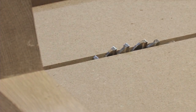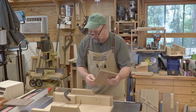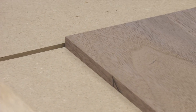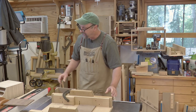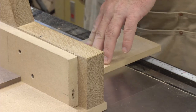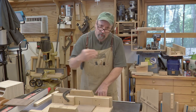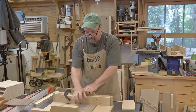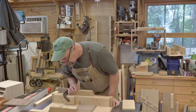I have a tick mark about a half an inch in from the leading edge of this piece, and I put that against my crosscut fence and slide it forward until that tick mark is even with the tooth that's just flush with the tabletop. With this in place, I want to add a stop to the back of the sled so I can repeatedly make this cut without it moving, and also so the sled doesn't slide back as I'm dropping the workpiece down onto the spinning blade — that's probably the scariest part.